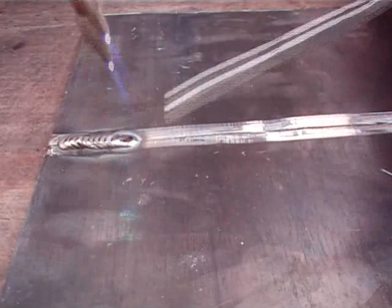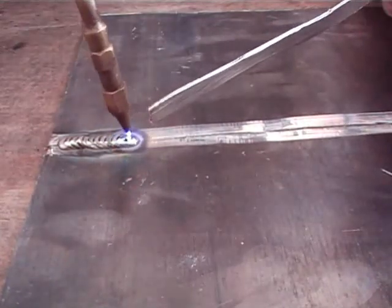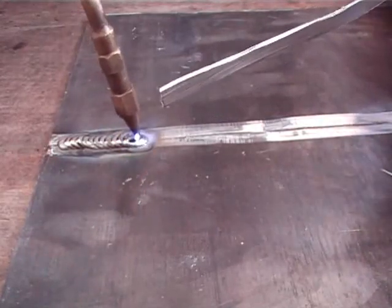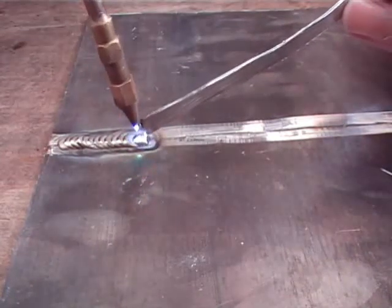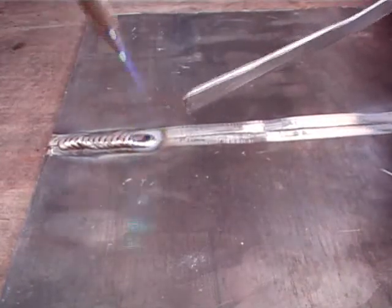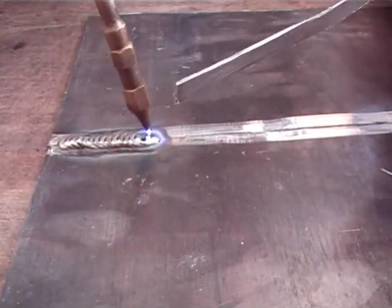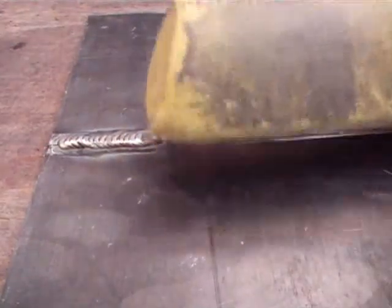Dimple, wait, melt it down, push it forward. Dimple — melt the 2mm off, keep it there until it reaches the width of the weld, push it forward 2mm. This is the sequence of events you've got to keep going over in your mind until you've got it off pat. All the time, check your flame and check the colours to make sure everything's okay.